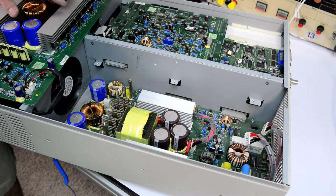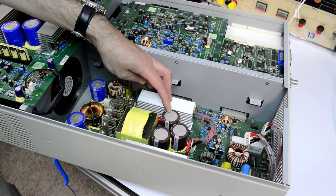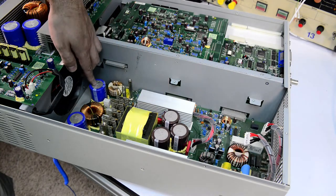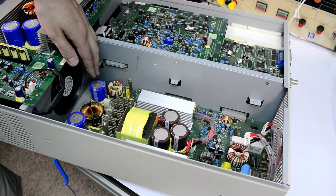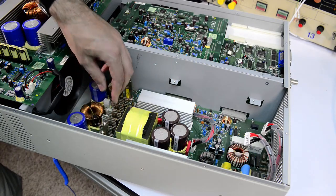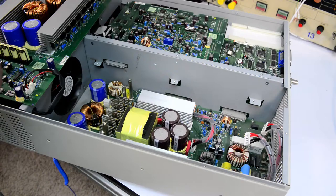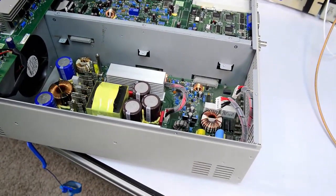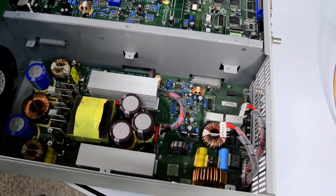I was just describing some parts here. So big capacitors, 470 microfarad, 450 volts. These are 560, 350, 105 degrees rating. These are posts that we were disconnecting from this board. Otherwise, it's very nice construction. Lot of high power stuff in here. Very cool.